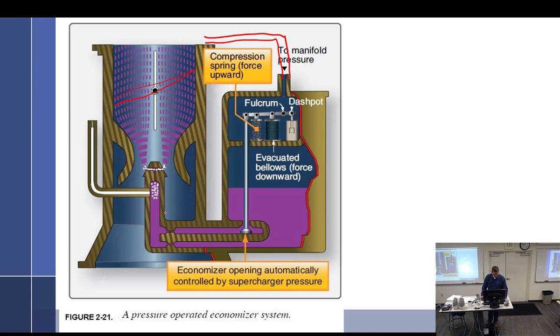All right, so now, if we're part, it's really more of a part throttle thing, but I just did it that way. It's easier. So part throttle, we have still low pressure, same effect. As we open this up, the pressure up here is going to get closer to atmospheric, about 1 inch less. You're going to lose 1 inch of air across the Venturi in this restriction right here. So if it's 30 inches outside, we look at the barometer, and it's like, oh, look, it's 30 inches today. Right in here, it's going to be about 29, unless it's turbocharged or supercharged coming this way. Anyway, about 29, so we got 29 here. So that's pretty high pressure. So if we got high pressure, this is going to contract, pushing the rod down, allowing more fuel to go through.